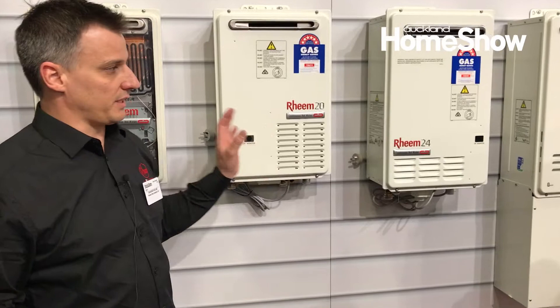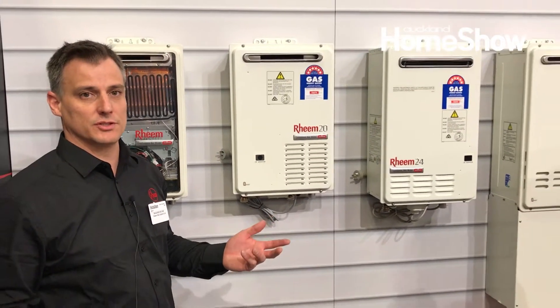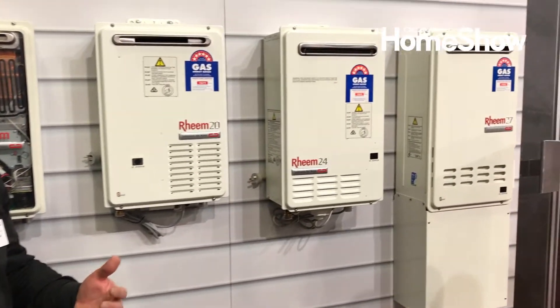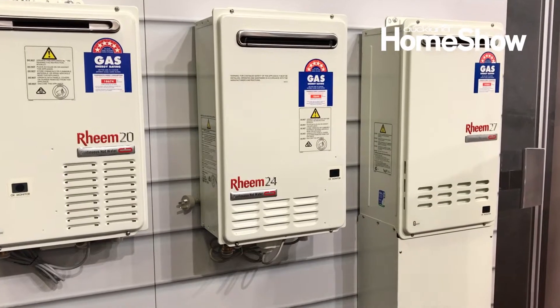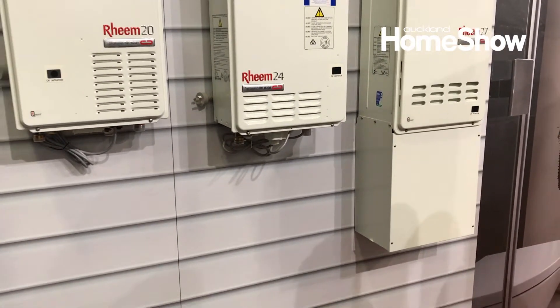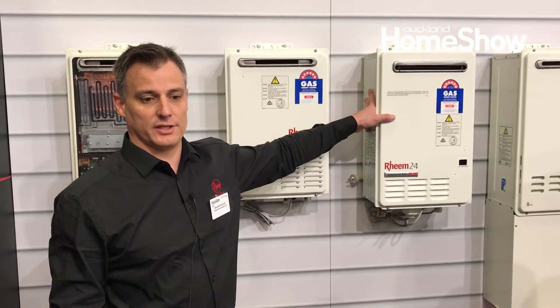So when you're trying to figure out how much you should use — if you've got two bathrooms using approximately 9 litres a minute per shower, that's 18 litres per minute. And if somebody is using the kitchen as well, probably another 6 litres, you work out to about 24 litres a minute, and that's how you kind of work out what product you need.